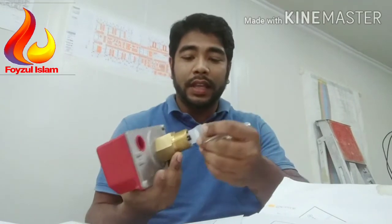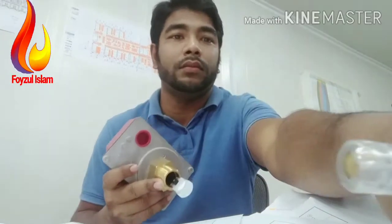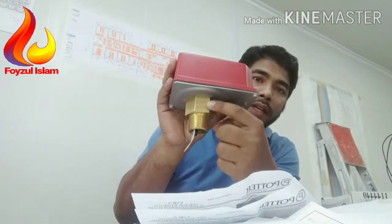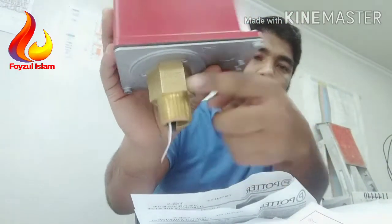Select the proper paddle for the pipe size and the type of tee used. The unit has a one-inch NPT bushing for threading into a non-processed tee. When installing this flow switch, you must check the direction of water flow — there is already an arrow indicating the direction. You must check this and set the flow switch accordingly.